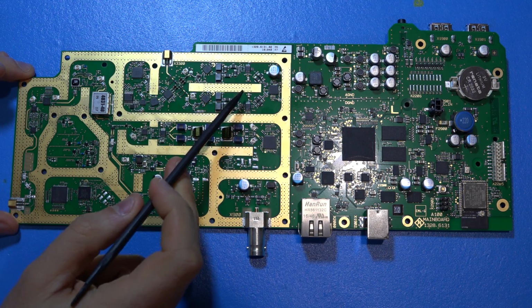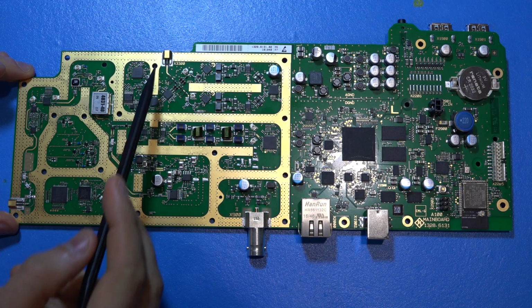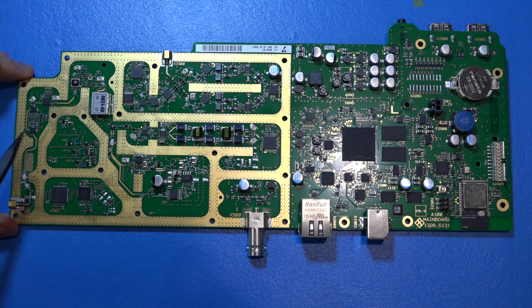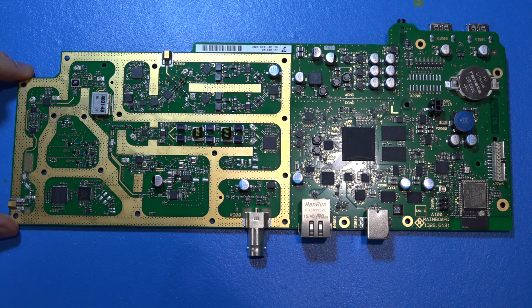So this is how we can do an S11 measurement. In vector based, we can do a scalar S21 measurement going from here all the way to here, and of course we can do spectral measurement. Now, because we have some IF bandwidth with a particular bandwidth coming out of here, we can do some digital demodulation as well. The A to D converter will be able to take care of that in the DSP domain into the Zynq FPGA. So all of that really comes together quite nicely.